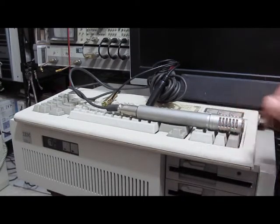And software for this demonstration is all written in assembler. I'm using an 8-bit A to D and an 8-bit DAC to digitize the sound. At the time I developed this, there was no Sound Blaster or other sound cards available, so people were rolling their own. One of the things that was common to get sound out of the PC was to use the printer port and wire a DAC to it and then amplify that signal, so people would just bit bang the printer port to get their audio out.